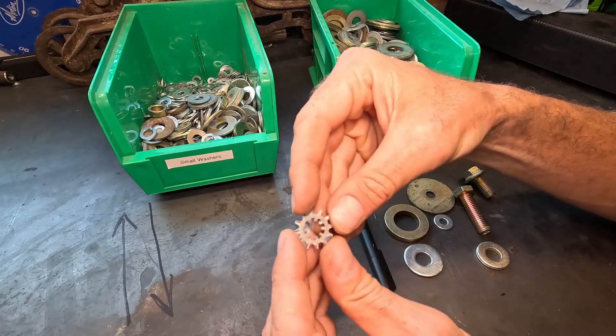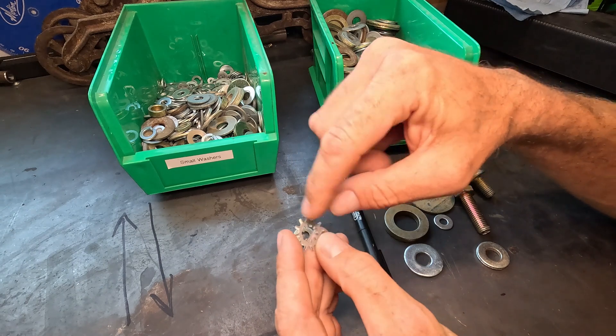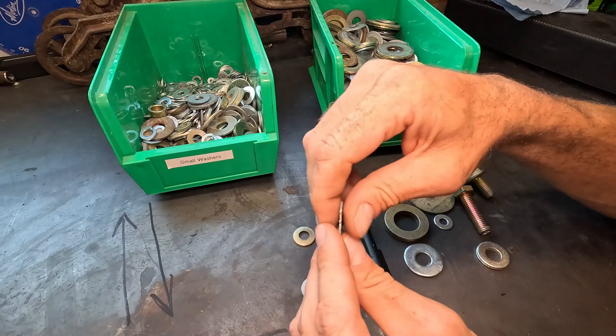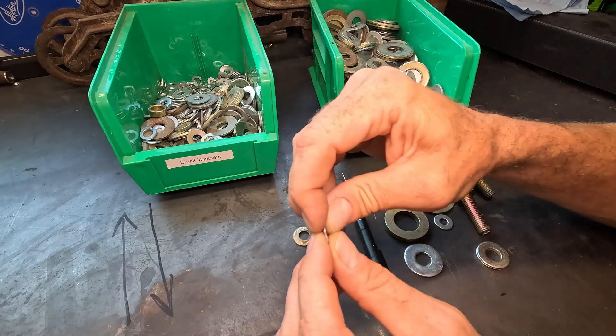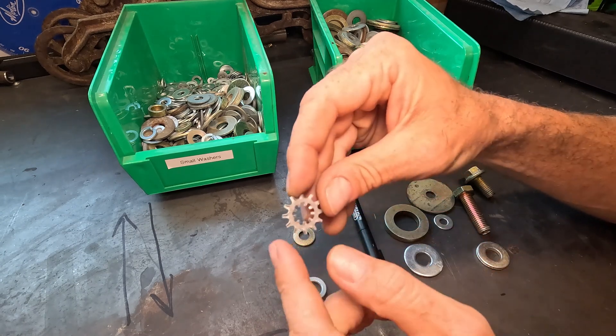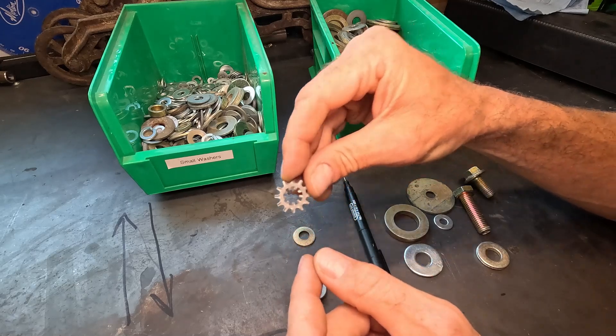You may also get these ones that look like a star, that have spikes on the inside or outside or both. If you feel these, what they do is grip the material. As you tighten down, it helps to lock that joint into place. It also helps prevent the washer from falling off with those inner spikes, but primarily it helps to secure the joint.